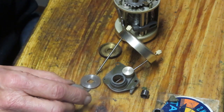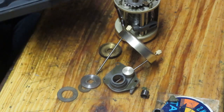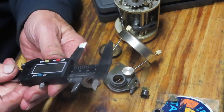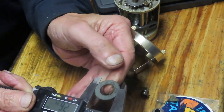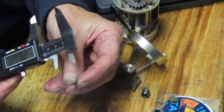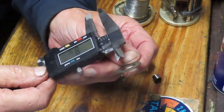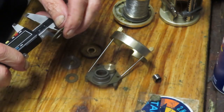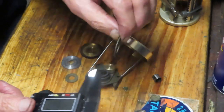This is the drag washer you want to measure. Most drag washers are sold in millimeters these days, not in inches, though sometimes you can find sellers who use inches. The best thing to do is get a digital caliper — that's what I have here. Turn it on and measure three dimensions. You want the outside diameter: this one reads just over 26 — 26.3mm. Then measure the inside diameter using the other side of the caliper, rolling the points out to get a reading: that's 15. So we have 26.3 outside by 15.3 inside, and the width — thickness — is 1.3mm.